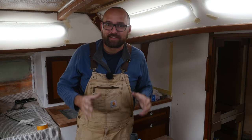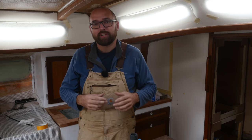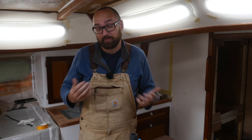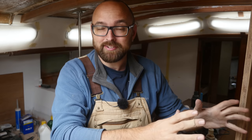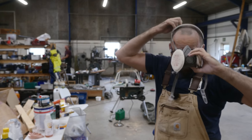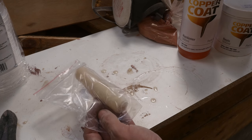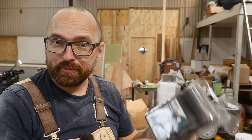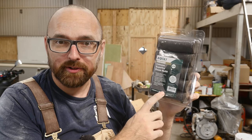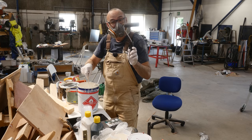The activation of the copper coat didn't turn out to be a complete success — we didn't finish the hull and there are large areas that need a lot more scrubbing or sanding. I think I might try going ahead with some 320-grit sandpaper instead of the Scotch-Brite pads. Today's a nice dry day so we'll table the copper coat until the next rainy day and switch to applying some epoxy primer to the fairing areas. After we ran out of Scotch-Brite pads yesterday, Ole and I applied a little bit of polyester filler to the pinholes in the fairing areas. Last week I applied epoxy primer with one of these mohair rollers and it wasn't really a great experience — I used these because I didn't have any foam rollers suited for the epoxy primer. Earlier this week some foam rollers showed up and these should hopefully be okay for the epoxy primer, meaning they shouldn't start to swell up or disintegrate.